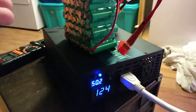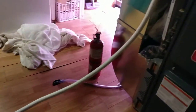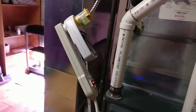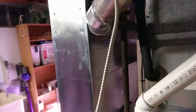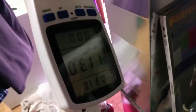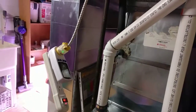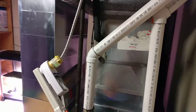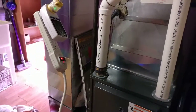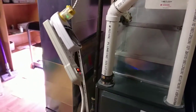It's currently sagging a bit because there's a heavy load, because my furnace is currently plugged into it. The furnace is currently pulling 410 watts. It's pulling more than normal right now because I shut it off mid-cycle, which probably isn't a good idea. So it's full blowers right now — it's the most that it will ever use. Generally when it's calling for heat, it pulls about 310 watts.